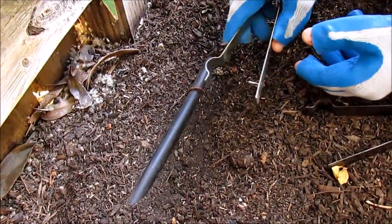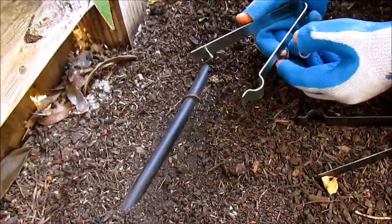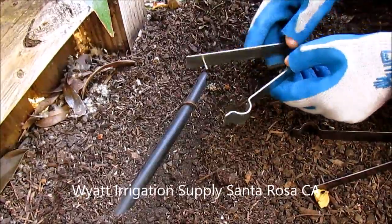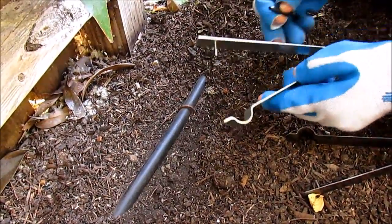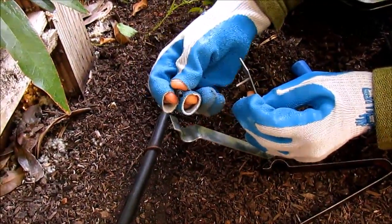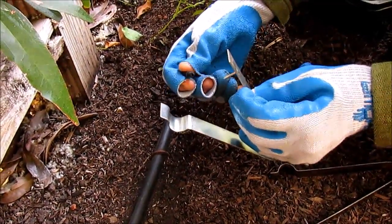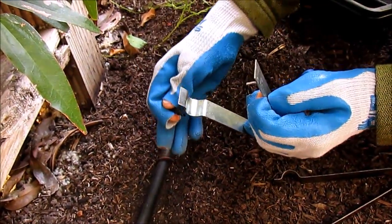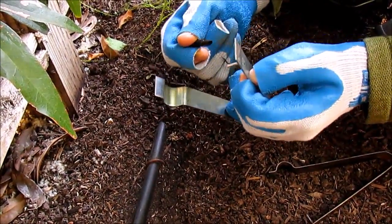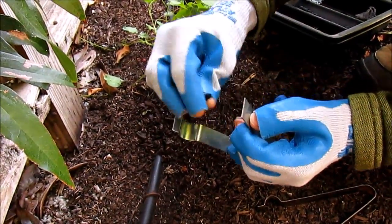It's a tong type and I buy this from Wyatt's Irrigation here in Santa Rosa — W-Y-A-T-T apostrophe S, Wyatt's Irrigation. I'm going to show you how to punch the hole, but first I want to talk about this for a second. When you first buy them and they're new, the industry that makes these little connectors is not talking to the industry that makes this hole punch. So when you pop a hole in your main line and go to insert the connector using these tongs, they don't just slide on the brand new ones anymore like they used to.